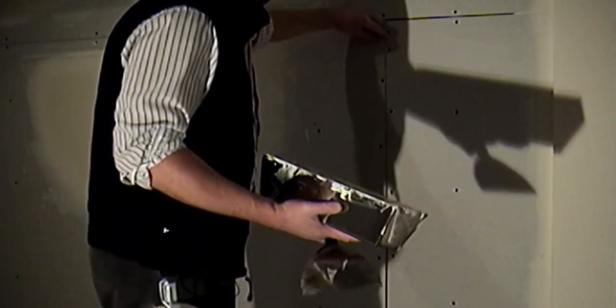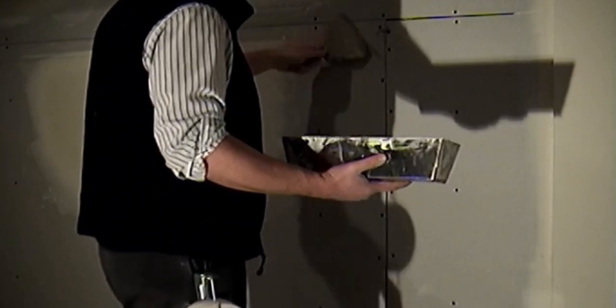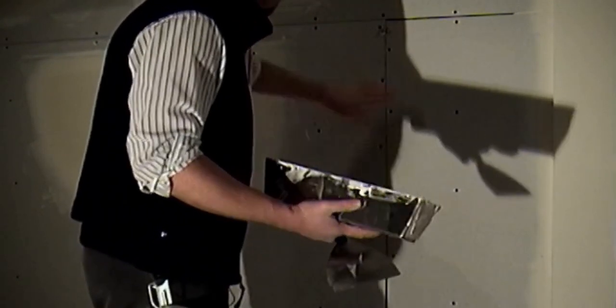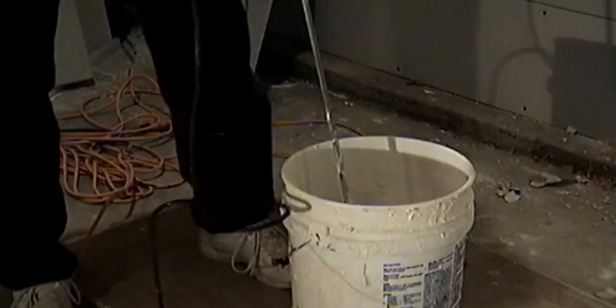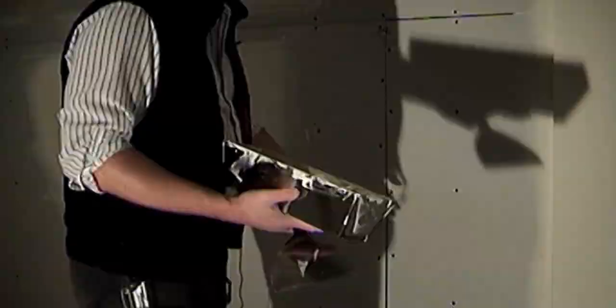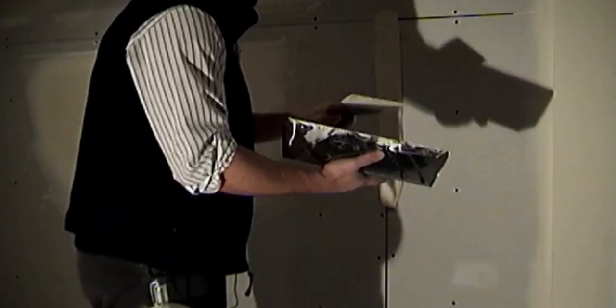Before you start your tape coat, you must chip out and pre-fill any damaged drywall before you start taping. Look for loose drywall paper, and peel it off. If you don't, it will result in a lifting of the paper after multiple coats of compound, or when you apply your PVA primer. At that point you will have to cut the bubble out with a knife, and repair your work. You don't want that.